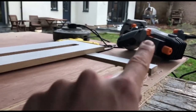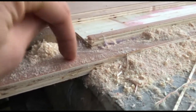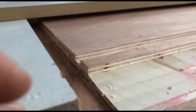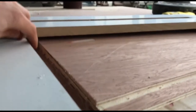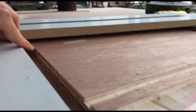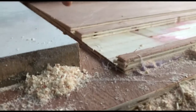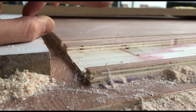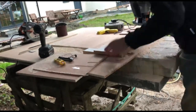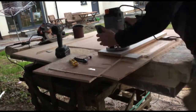I'm using a router with a little jig glued across the top to keep it flat, and I've got a nice flat piece of plywood. I've drawn a line all the way to the point where it's going to stop, and I'm just routing across and dropping the router bit to be level with this pencil line, going across cutting it every time. I'm speeding this process up — doing it as evenly as possible, one strip at a time.